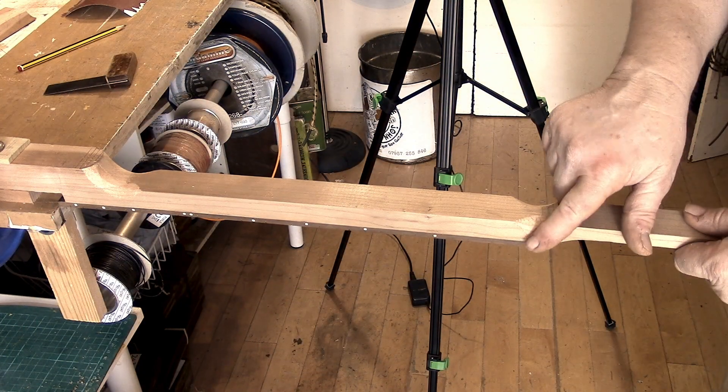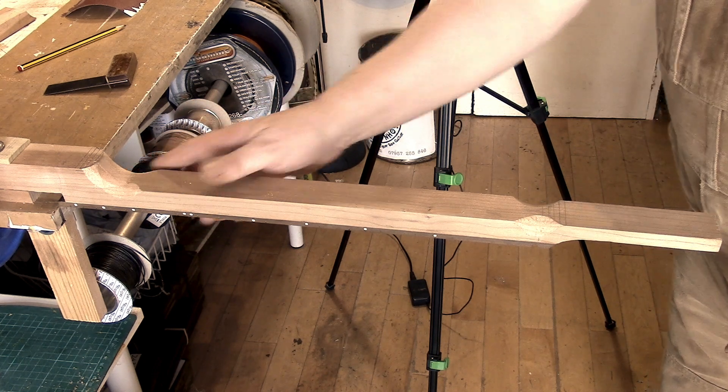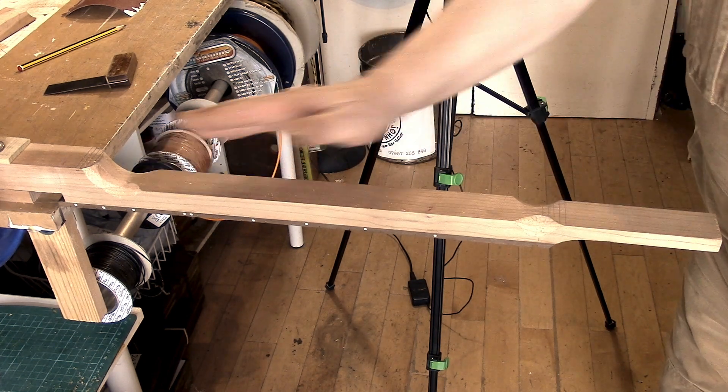I'm supporting the neck here — I've not got the neck stick support in for simplicity, so I'm just making sure I'm not over-stressing it. I'm rocking the rasp as I go, keep stopping and taking a look. I don't want to come right the way over into the middle and I don't want to come too far down. We've got these transitions roughed in, and now we're going to work between the two points.